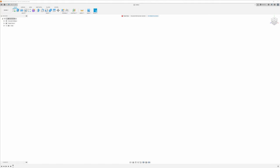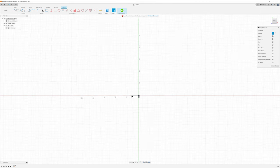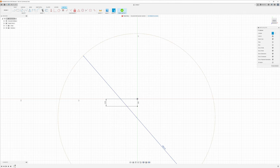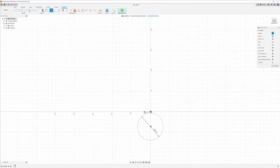I'm going to design a fork to hold my dosing cup. First I'll set my orientation so I'm looking down at Z, then open up a sketch. The first thing I'll do is set a little line to give me a center — I'll make it three millimeters because that corresponds to my backing plate depth. It's a construction line, just a marker so I know where I am. My dosing cup has a rim that's about 67 millimeters, so I'm making this diameter 68 as a reference for the outside, making sure it's coincident and vertical to my center plane.